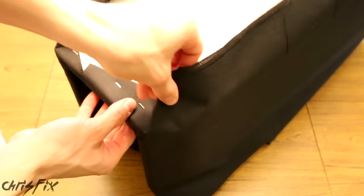Now I'm going to trim off this extra material at the top to make it easier to work with, and I'm carefully going to make a small cut right here, and that will allow us to fold the material over and pull it tight just like that. Now we can get that stapled in place and staple the rest of this side so it's tight. Follow the same procedure on the other side as well. Carefully make a small cut, and staple that side in place so it's nice and tight, and secure the rest of this side with staples. Let's cut this flap of material just hanging out here, and if you do make a mistake or don't like how something looks, don't worry — staples can be easily removed with a flathead screwdriver, then adjust your material and restaple the area.